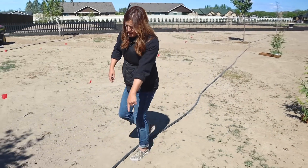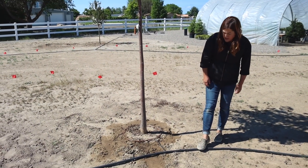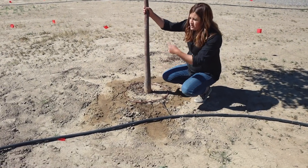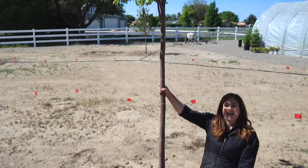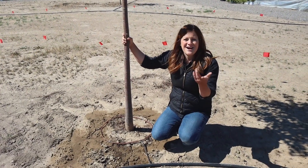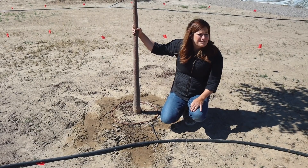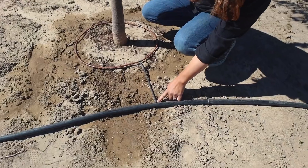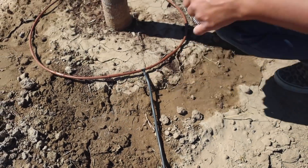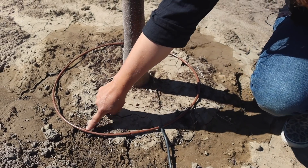Right to my right there's the orchard and the cut flower garden, which are irrigated very differently than how we're irrigating the corners that we're planting heavily with trees, evergreens, and shrubs. You can see right here — this is our water supply line. We decided to go with three-quarter inch tubing because we are going quite a distance, so that's better than doing half inch in this case. When we get to a tree, we tap into it with a quarter inch coupler and run quarter inch black poly.